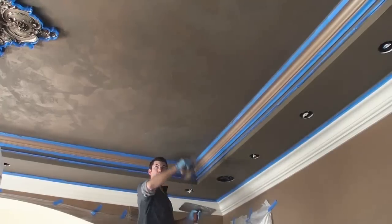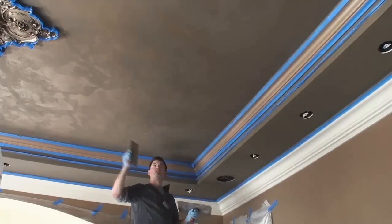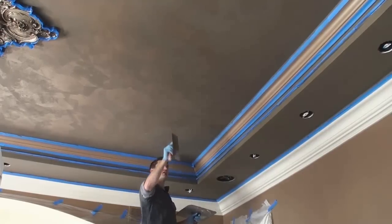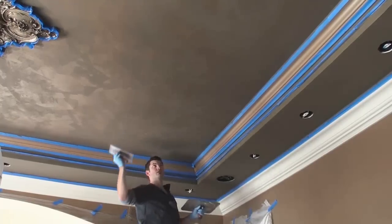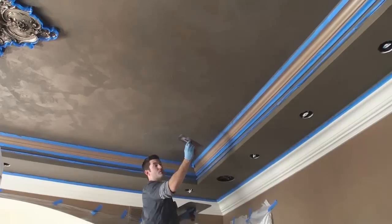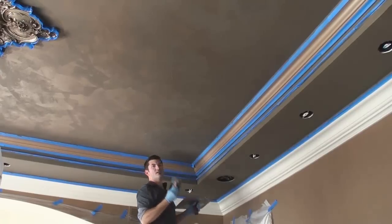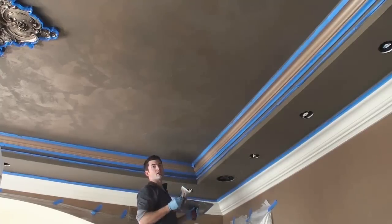What you want to do when working a larger surface area is keep a wet edge. So I'm not just going to trowel completely one way then come back the other way like I'm mowing a lawn. I'm going to move around the edge and it's going to get bigger and bigger — I have to keep moving. You don't want to let one area of the edge set up, because if you come back and trowel into it and it's setting up, you're going to skim the top off and get a really ugly look or a hard line. Get a game plan, and if it's too large an area, have a second person helping you trowel.